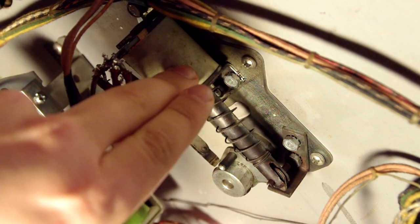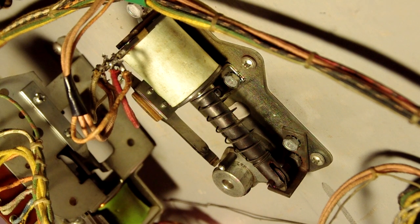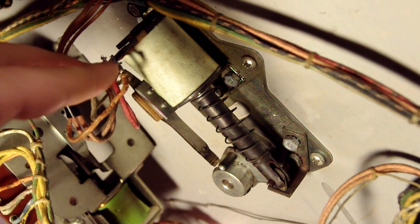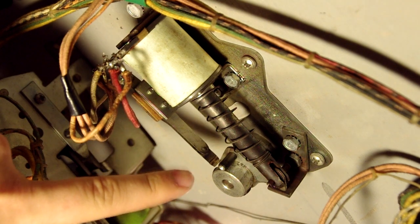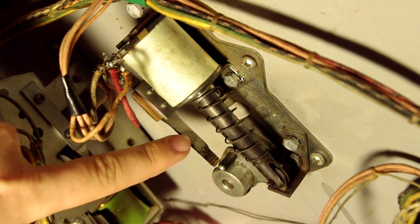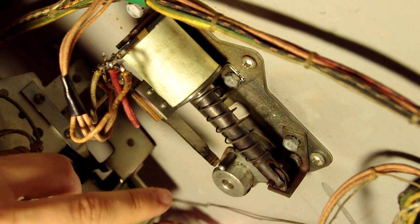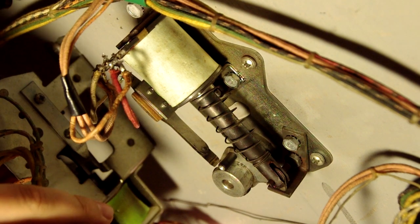When power is run through the coil it forces the shaft of the solenoid inside because of an electromagnetic field. The coil is very powerful and actually too powerful to stay on for any length of time, so flipper solenoids are actually two solenoids in one. On the back there are three different terminals — two represent the high power winding and the other two represent the low power winding; they share a common negative. When the flipper reaches its end of stroke it opens the end of stroke switch, or EOS switch. When closed, this switch allows power through the high power winding. When open, power is only allowed through the low power coil. This allows for a very high powered kick while letting the flipper stay in the up position without hurting the solenoid.